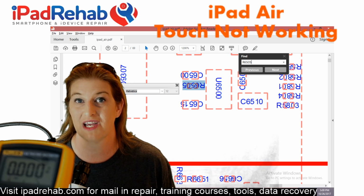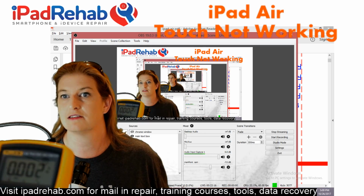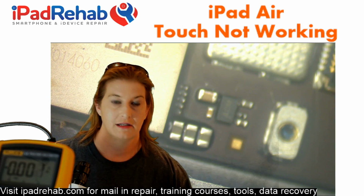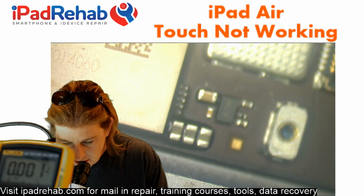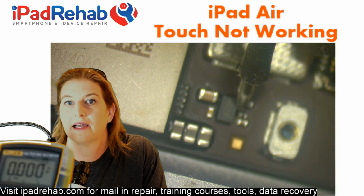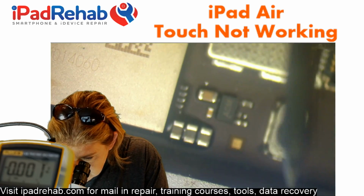So we should be able to measure that, PP1V8 grape should be on that. So let's see if it is. We're going to continue doing the same old thing. Get rid of schematics, bring back microscope, and disconnect. Wake up the screen. And now we'll take our voltage here. What is it? I can't see it because of this stupid thing in the way. All right, let's see. What is it?